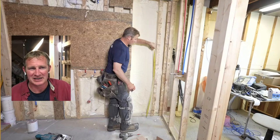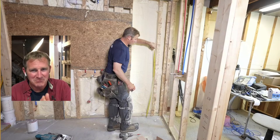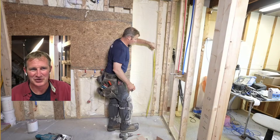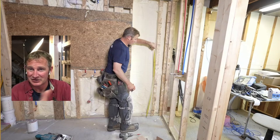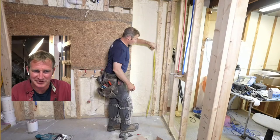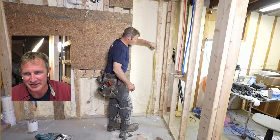So almost any shower that I've ever done, unless it was completely square, rectified marble tile or something like that, have I ever been able to mathematically make sure everything works out. It just makes a lot of sense, especially with tile like that. That tile was definitely imperfect. At first it didn't have square edges, it had kind of an unsquare edge all the way around. It's not handmade, but it kind of looks like it, so that makes it even worse. So spacing it all out will give you a good gauge on it.